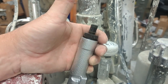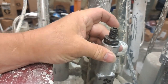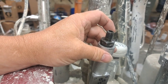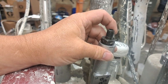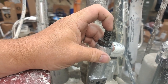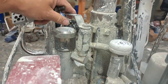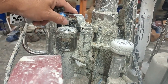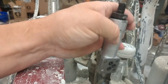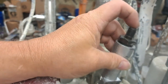Now that you've got the knob off, do not take this off of the hydraulic pump — leave this on. Once it looks like this and the knob is off, you'll start your machine. A pressure gauge is perfect to have for your fluid, but if you don't have a pressure gauge, you're going to have to do this by sound. Take this, put your Allen wrench in it, and screw it down counterclockwise about three turns — that drops the pressure. Then start it up, open the prime valve to let the pressure off. Then once the pressure is off and you've got the system primed up, close your prime valve again, let it build pressure and stop. Then take an Allen wrench and turn it a half a turn — it'll start to build pressure more.